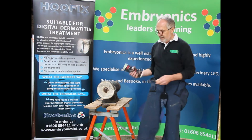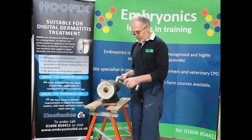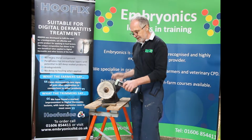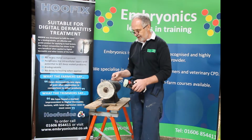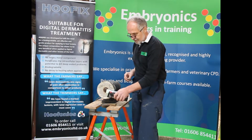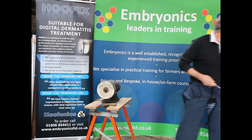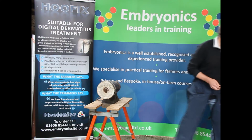For the buffer wheel, you need the paste. So we'll apply some while we're sharpening the knife to show you how we apply it, but you apply some paste, and it's the paste and wheel combination that does the final buffing and sharpening of the knife. So we'll start sharpening.